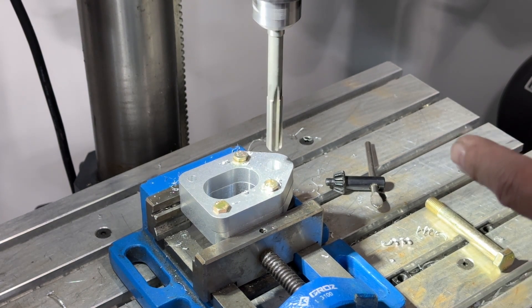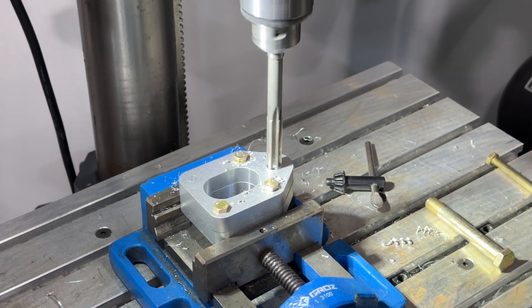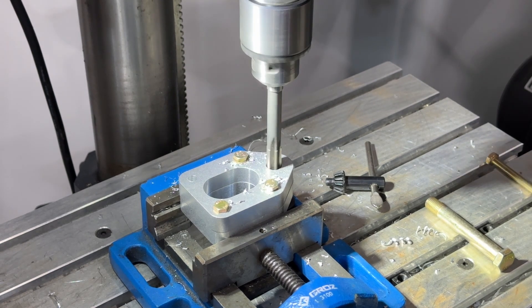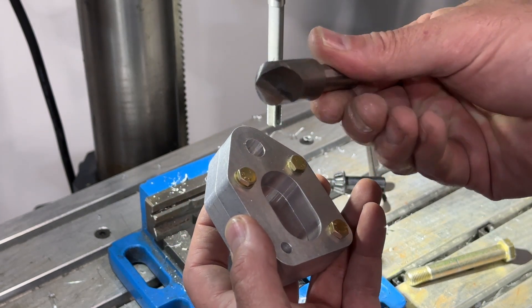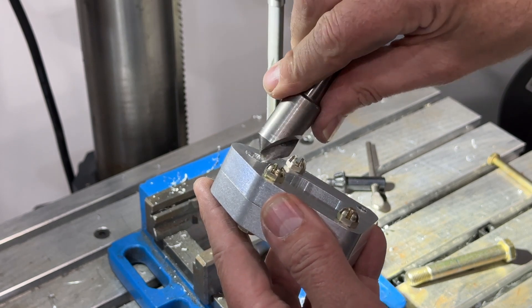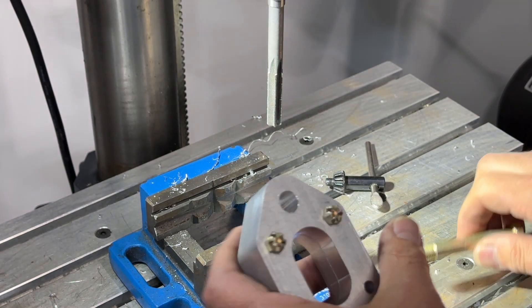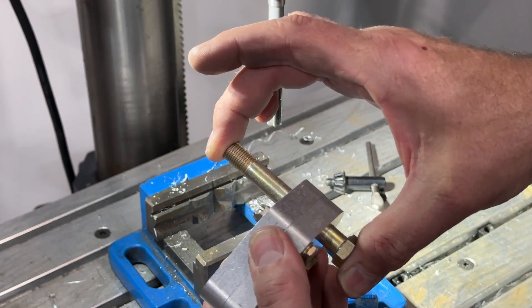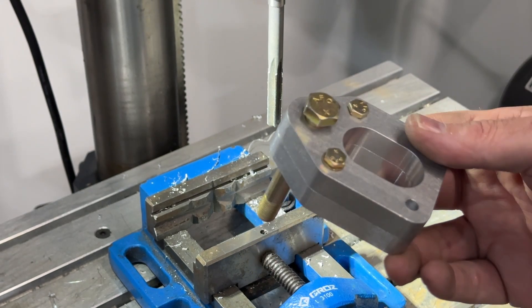You really want to peck at it with these reamers - straight flute reamers don't pull the chips out. There we go, that worked. I'm going to do a light deburr on both sides here, just hand-do it with a little countersink bit to get a lid on that burr. Mostly the burring was on the back side. I'll put these on the drill press and do a proper chamfer, but this is just to get those burrs out. Let me check the fit of the AN7 - it is perfect. There is no lateral play to speak of, yet it's a slip fit.